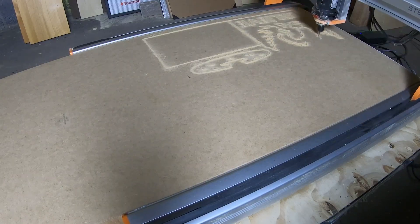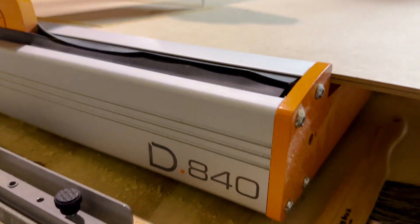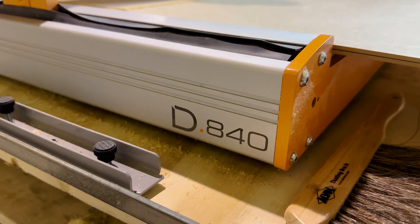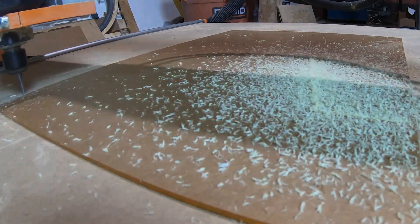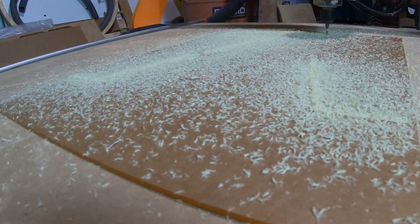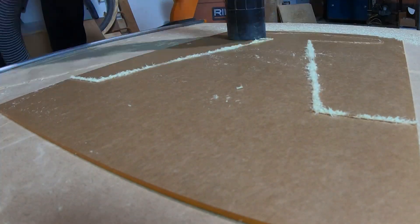These cuts look amazing and I ended up using a 1/16th-inch down-cut bit for this. Right out of the box everything worked great. For the plexiglass, I'm using an eighth-inch single-flute bit for a much cleaner cut on the acrylic. I'll have links in the description for everything, but once the bit was aligned I just had to hit start and away it went.